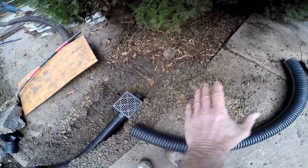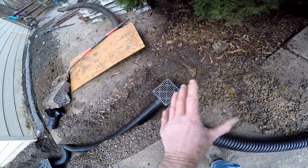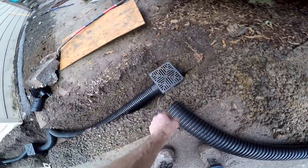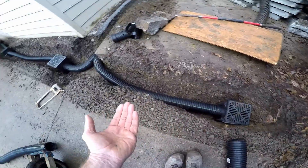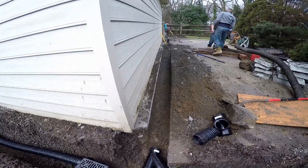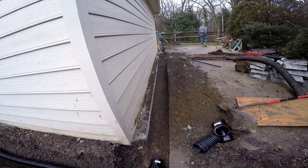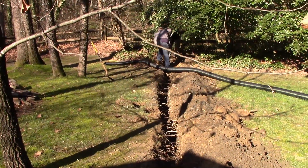Water comes off the driveway and drops into the catch basins. Remember, this is also gravel — gravel acts just like a catch basin or a channel drain. There are voids in the gravel; water drops right through it down to the bottom of the pipe. At the bottom of the pipe there are holes that allow water to flood up into your system. It all comes down and runs all the way over through this walk. We're also going to add a drain in the center to help pick up any water missed by the system, and we'll slope the concrete towards it ever so slightly.